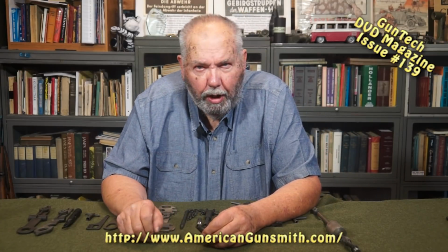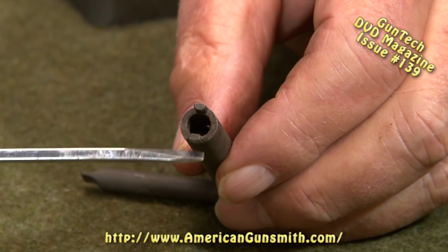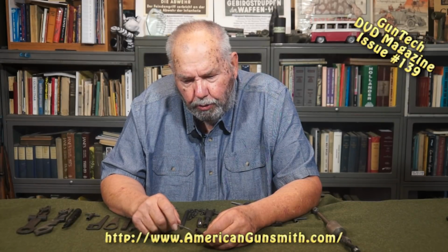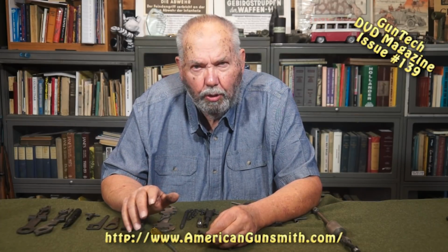Now the Enfield rifle, both the number 1 and the number 4, have a firing pin that has half circle cuts in it, which you can see here match up with these. So the firing pin tip goes in the hole. These two lock around the firing pin on the outside edge where those half moon cuts are, and you can unscrew it, no problem at all.